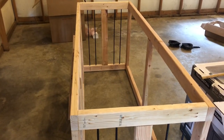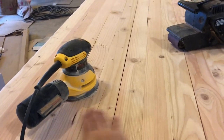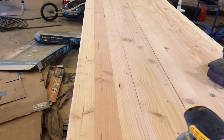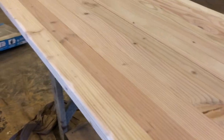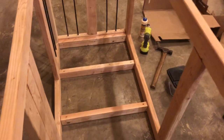I think I'm almost done with the final sanding. I started with the belt sander and got everything planed down nice and smooth from board to board to get rid of the irregularities, then cleaned it up and went from 80 grit down to 120 and so on. I put some little indentations in a couple of places just to make it look a bit more distressed, but I wanted it nice and smooth so that if we set stuff on top we wouldn't get splinters — make a nice tabletop.